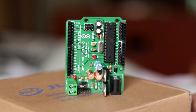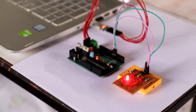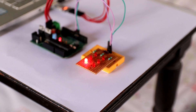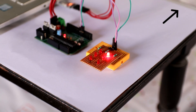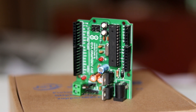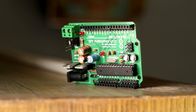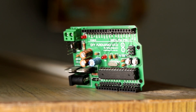So this is the final product in front of us. You can also see the 5V and 3.3V power supplies are working well. I've also uploaded a Charlieplexing sketch and it's working fine — you can control 6 LEDs using just 3 pins of the Arduino. The project is almost complete. I hope you've learned something new and liked this project. If you did, please like this video and subscribe to our channel — it's free and it keeps us motivated to come up with more videos. Thank you for watching, see you in the next video. Till then, bye and take care.